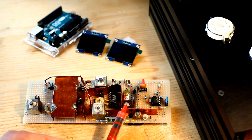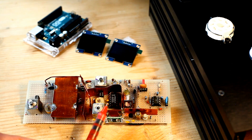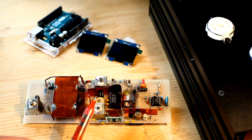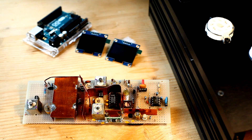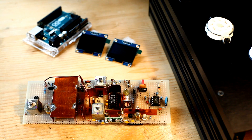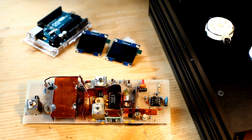In order to achieve this lower output frequency, this integrated circuit generates a second signal via an internal oscillator — you can see the local oscillator coil here. This oscillator generates a signal 10.7 MHz higher than the received station frequency. By mixing the received signal and the local oscillator signal, the IC generates an output signal whose frequency is the difference between the two, which is exactly 10.7 MHz.